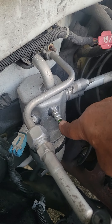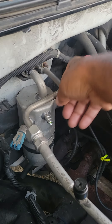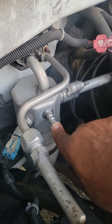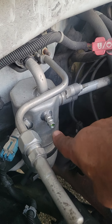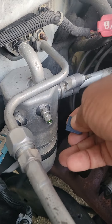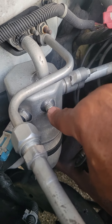Inside of the service ports are Schrader valves — they're nothing more than little valves that go bad. How do you know when the Schrader valve has gone bad? You can put your finger over the port — if you feel pressure, you know you have a leak. You can put a small balloon over the service port — if it blows up, you know you have a leak. You can spray water inside — if it bubbles up, you know you have a leak. If the valve is stuck open, even with the cap on or off, you may see excessive Freon dripping down, which is a sign of a leak.